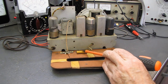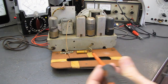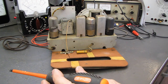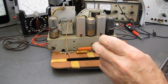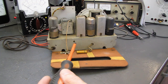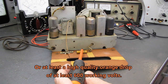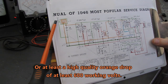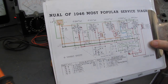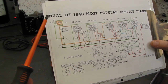While this is forefront in my mind, I want to mention this capacitor here that's on the antenna loop. On the sets that have an external antenna connection, as this one does, you can use either the loop antenna or connect an external antenna for much stronger reception. That capacitor should be one of the Y rated capacitors, in other words, AC to ground. That capacitor is right here on this part of the antenna circuit. And I've color coded this so it'll be easier to follow later on for the guys who are just getting started here.